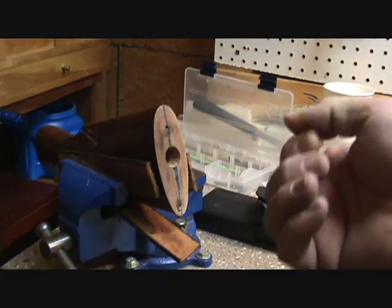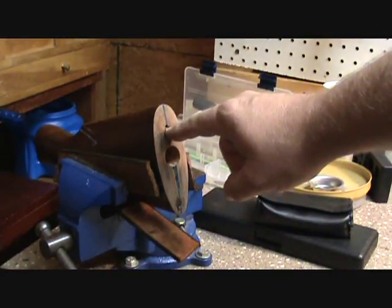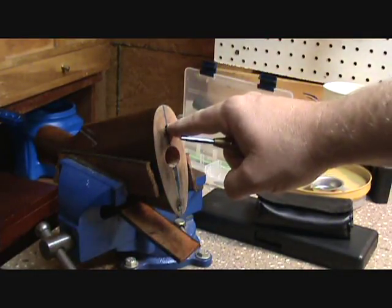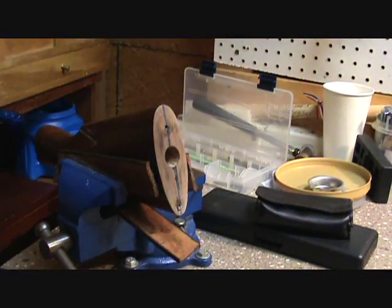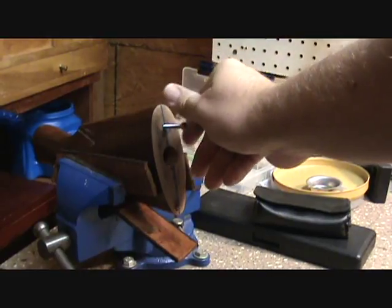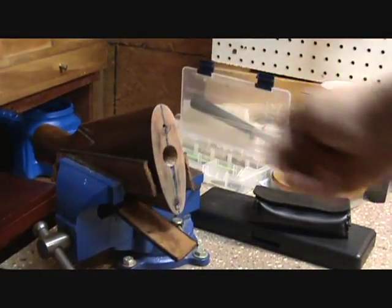I think I used a little small 1/8 inch drill bit — it says in the information when you buy the pad what size to use. Where I had my center punch marked through the recoil pad, I just drilled into that. Then I took the screws, put a little Dawn dish liquid on them, and just turned them in on just the top side.